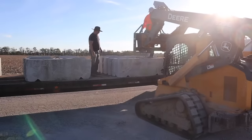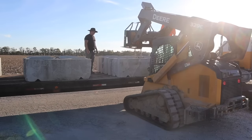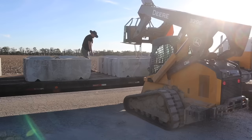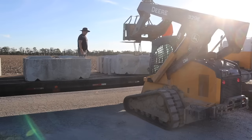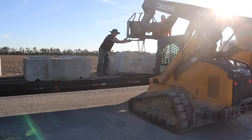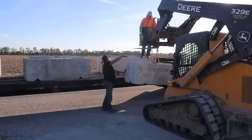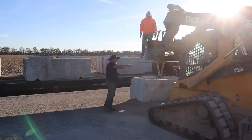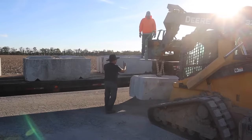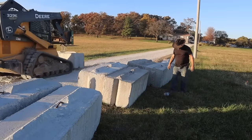Later the same day, I took delivery of 20 of these giant construction blocks that we used as a foundation to set the building on. The reason we did that is a Quonset hut has arched sides, and as soon as that arch starts, you lose the ability to stack anything against the walls. Raising it 2 foot makes the building more usable.